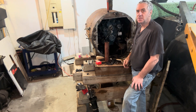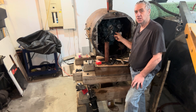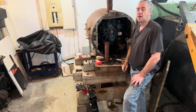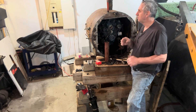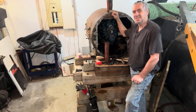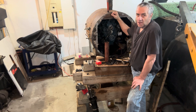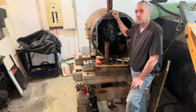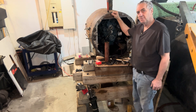The new engine for my diesel electric submarine is in — that's my Kubota three-cylinder diesel. It has a max horsepower of 21, 16.8 continuous, but the machine it was running in was running 10 horsepower at 2200 RPM, so I'll be slightly above 2200 RPM for the amount of hydraulic flow that I need.